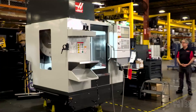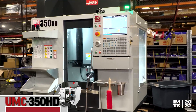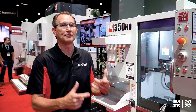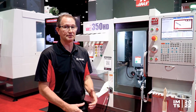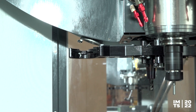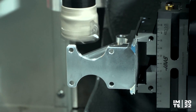Hi, I'm Mike Steinbach and I'm here at the show. I wanted to show you something that's getting a lot of attention — it's really cool and worth taking a look at. We've just come out with the UMC 350, or I should say we're designing it and it'll be released soon. The UMC 350 HD is based upon a couple of really popular platforms that already exist within the Haas lineup. If you take a DM-1, which is a small vertical machining center, and you take our existing TRT 210 and put them together, you've got the UMC 350 HD — a 40 taper, 5-axis universal machining center that does great work on small parts.